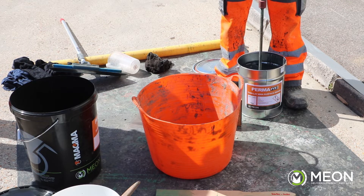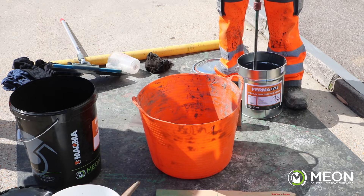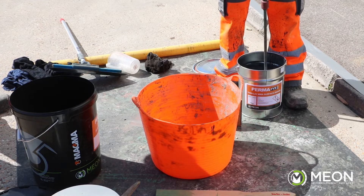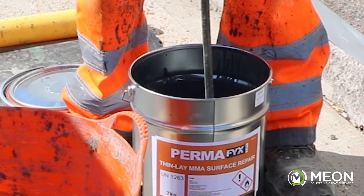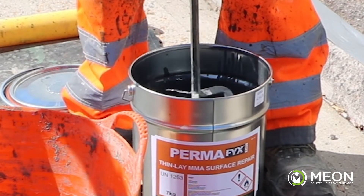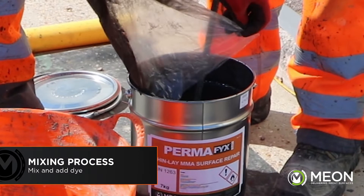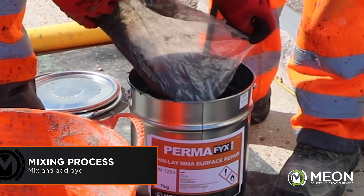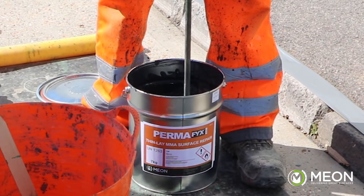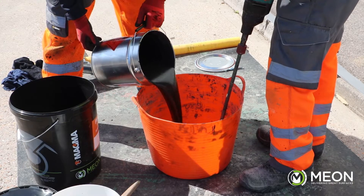We have the option to adjust the color of the product. The base resin is provided in gray, which can be ideal if you want to repair an area with old asphalt surrounding it that has faded, as it will blend in better than a bold black repair. However, asphalt can be a range of different shades, so the kit includes four black dye sachets which you can add in whatever quantity required to adjust the color. We pour in the dye and mix again until the color is completely consistent throughout. It is important to mix properly at this stage, otherwise the application could look inconsistent in color. Make a note of how much dye has been added if you're mixing multiple kits so you can get a consistent color for the whole application.